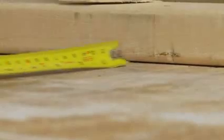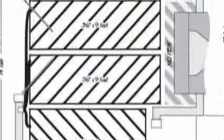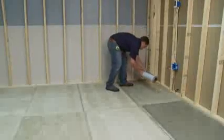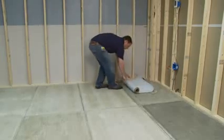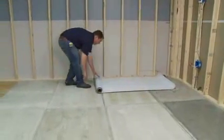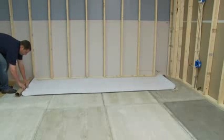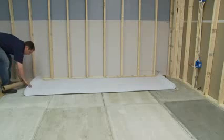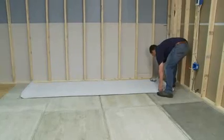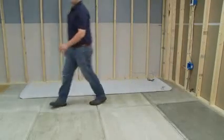To select the proper size heating mat, measure the area to be heated and determine the heating mat widths and lengths from wall to wall. Accurate dimensions are required for the proper size selection or for custom mats to be ordered and fabricated. It is important to allow up to 6 inches of clearance around the perimeter of the room, and from any baseboard heating or permanent fixtures to allow the mats to fit without touching adjacent vertical surfaces or overlapping.